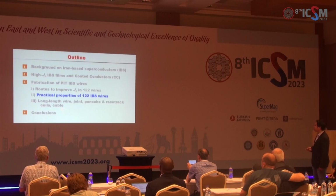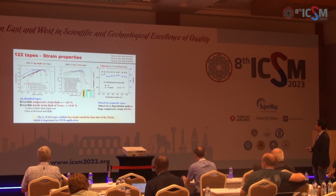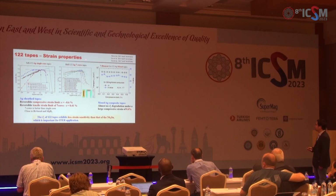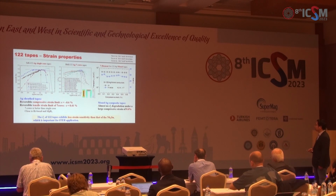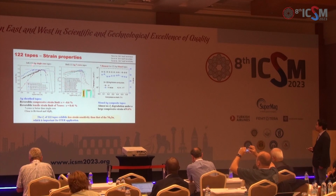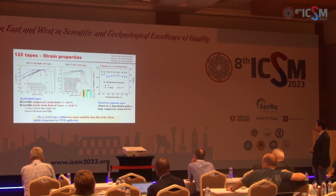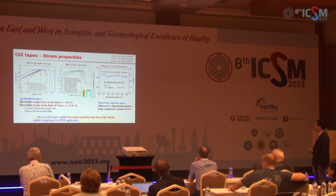In the second part of this section, I will talk about the important properties related to the practical applications. And firstly, we cooperate with the Institute of Plasma Physics in China and study the strain stress properties. We found the same reversible compressive strain limit for the single core tapes as well as multifilament tapes, about 0.6%, but the tensile strain limit is relatively low. For the 7 core tapes, the tensile strain is 0.4%. But this value is close to the Bi-based and iron-based round wire tapes as well as MgB2.